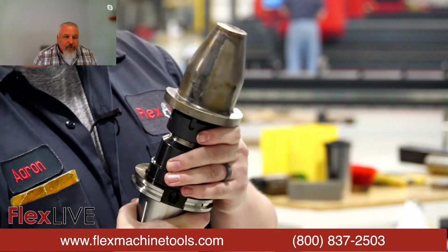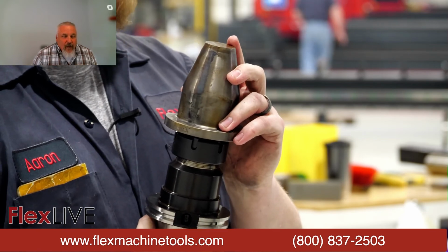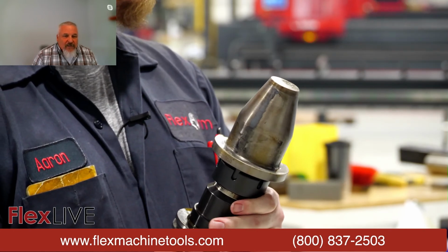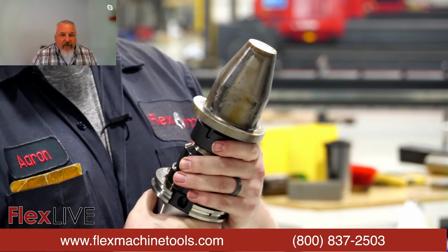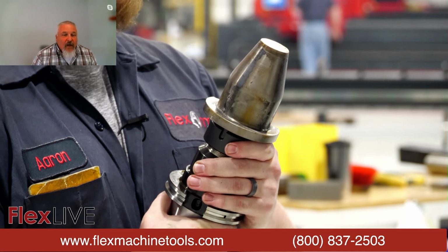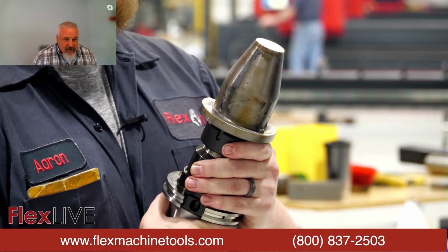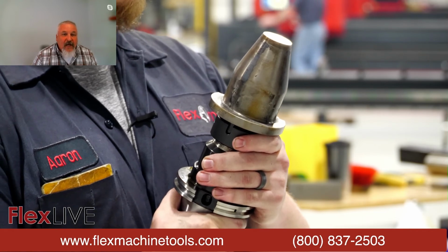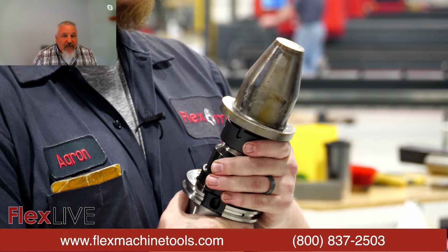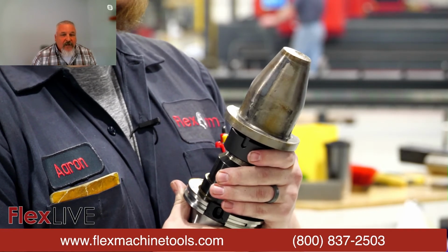Now explain what we had to do with this big one. I guess we didn't get a close-up of the other ones, but the other drills that we used in today's demonstration had a point, and this one has a blunt end. So we had to start with a just over 1.5 inch pre-drilled hole. Can you explain why we had to do that? This bit was used in an actual tube application previously, so we were limited in space. So we had to blunt the end so we didn't hit the opposing wall. That's why that bit looks like it does. Typically it would come to a point just like the smaller tools that we produce. But this one did require a pilot hole. When we get to this kind of size, generally speaking, we are probably going to use a pilot hole anyway. What that does is help decrease the amount of load on the machine and against the part. It helps prevent some deflection and lessens the load against the bit and the machine.